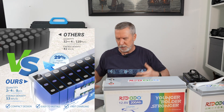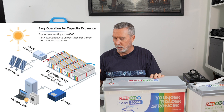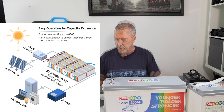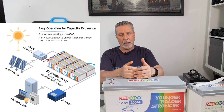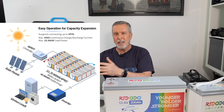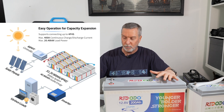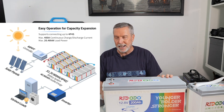Lead acid is so heavy, it leaks fluid, ruins your clothes, gives off fumes. Do yourself a favor and throw out your lead acid batteries. The BMS also supports a 100-amp discharge and charge rate per battery — so four in parallel gives you 400 amps in and out. In a maximum 4S4P configuration, with four batteries in series (voltage goes 12, 24, 36, 48V — actually 51.2V because LiFePO4 runs around 13V each) and four in parallel, you get 800 amp hours at 51.2 volts for a total of 40.96 kilowatt hours. You can run an entire house off that.